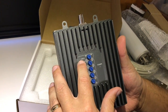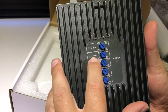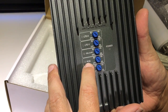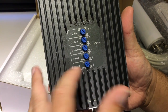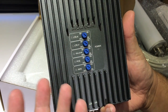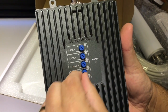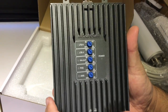The bands covered are: the 700 MHz AT&T band (T-Mobile band is also in there), the 700 MHz Verizon band, the 850 MHz traditional cellular band, the 1900 MHz PCS band, and the 1700–2100 MHz LTE band 4. It would be nice if they'd actually labeled the LTE bands instead of making you translate between LTE bands and the labels. You use a small screwdriver or your fingertips to adjust how much gain each band is putting out.